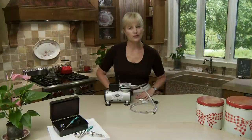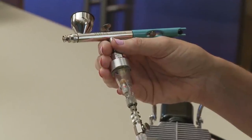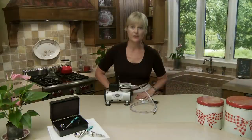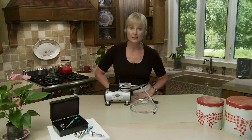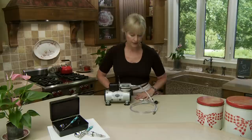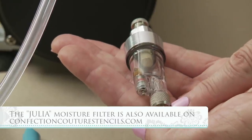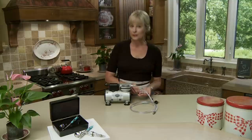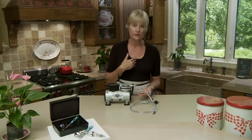Let's talk about inserting a moisture trap as option one into the line, also known as a moisture filter. There are a couple of benefits. First, once it's in, it can stay in, and it will 100% prevent moisture from traveling through the line and getting onto your product. None of the other two methods I'm going to show are a safeguard against it, but this is a 100% safeguard. The downside is it costs a little bit of money, but it's a relatively inexpensive part — you can find it for 10 to 20 dollars depending on where you find it online. The part looks something like this and comes from Badger, with a threaded end, a smaller threaded end, and a larger quick connect end on top. I'm going to show you two placements of it in the line and talk about the pros and cons. My personal preference is to insert the moisture trap exactly as it comes with the fittings where they are.